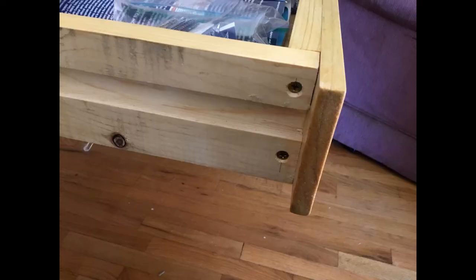And here is the only actual visible screw head you'll see. That's in the drawer. Now look, very simple joining, butt joints, and two screws top and bottom, with a hardwood oak rail the drawer rides on. Other than that, that's the only screw you can see in this whole case. Again, very simple structured design for any beginner at all.